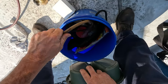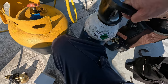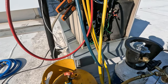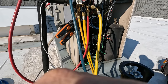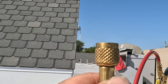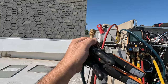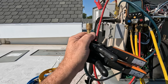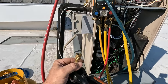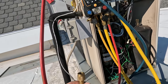The benefit of the bucket here is everything comes out when you need it and goes back when you don't — makes it easier to get everything on one trip. Let's go ahead and purge both directions, try to get as much out of the coil and condenser as possible. That way in spots where we can't get it to flow through, we'll have it free of any oxygen and less likely to have carbon. To check, hold it up and look for any distortion — if there's any refrigerant in there, it's going to cause a wiggle and a disturbance in the visual. We purged through the high side, so that would have gone down through the evaporator and back up — the evaporator is clear.